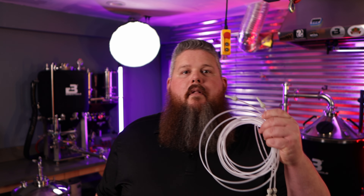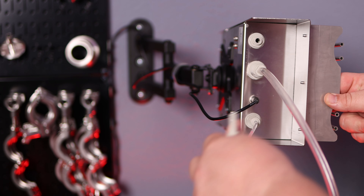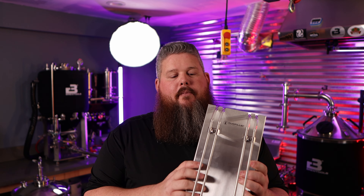The other end of the beer supply lines are these minimal little tiny tubing. This actually provides resistance and helps with controlling foam, and these just push right into the bottom of the Duofiller — super simple, super easy. It's not a counter pressure filler, so it does not do anything to mitigate foam. It does have an oxygen purge, which runs through one of these tubes and will purge the can of any oxygen. When setting up the oxygen purge, it is highly beneficial to use as little pressure as possible — you want to slowly displace whatever's in that can with CO2.